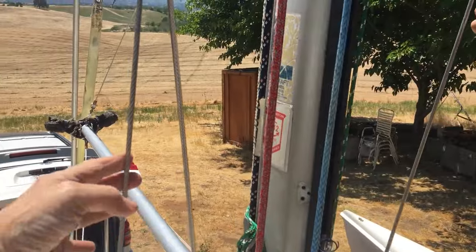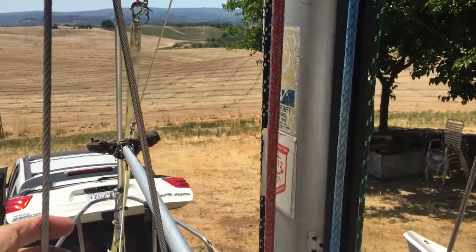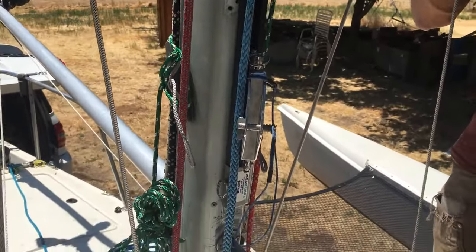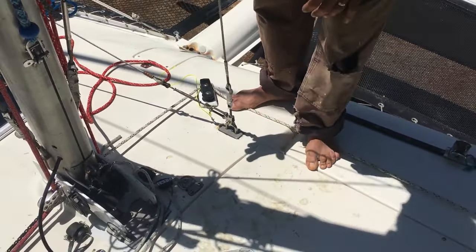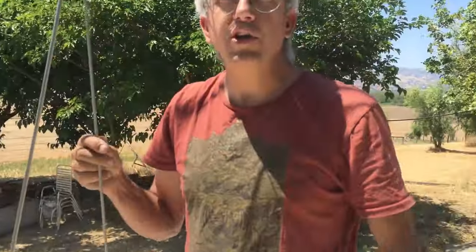And the same with these — because they're snug, but you can pull them and tighten them up by hand. We put in turnbuckles so that we could fine tune it. Here are the turnbuckles, and these as well. We just tune it until they're just not even quite snug — a little bit loose. And that's enough to keep it from doing anything weird on the way up, and not tight enough that it makes it hard to put the pins in the bottom pivot.